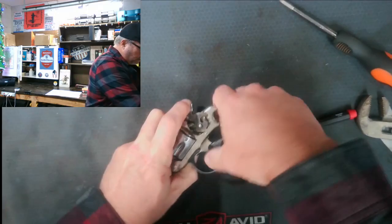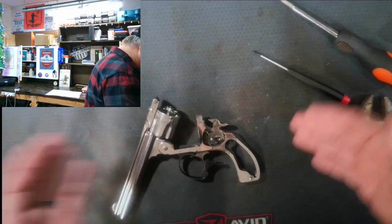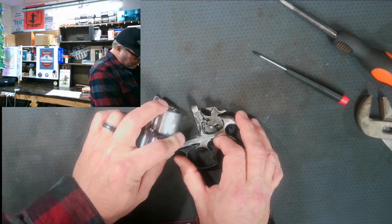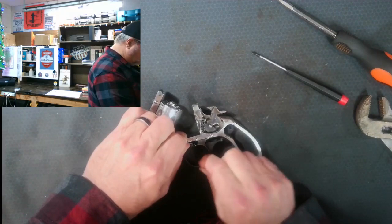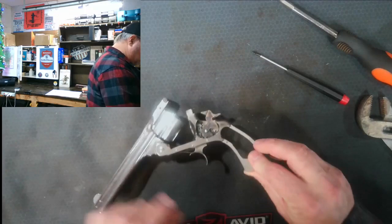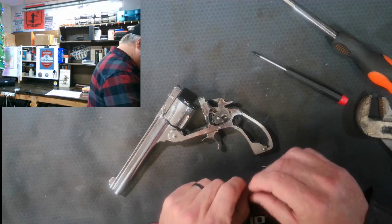You have to be careful. Pull the trigger back, pull the hammer back — there's no pressure in here. The reason I was struggling is I had the barrel closed; it moves very freely once open. Slide the trigger guard back. Inside is the trigger spring, so be careful you don't lose it. The trigger guard is off — we'll put that to the side. The trigger spring sits right on top here; it takes a little finesse to put back.